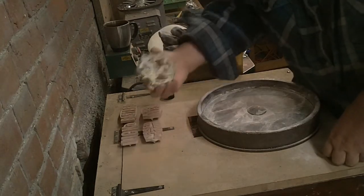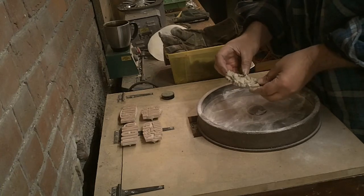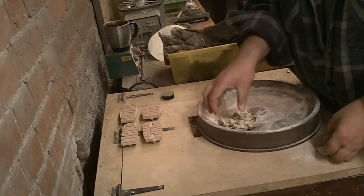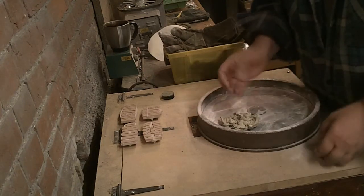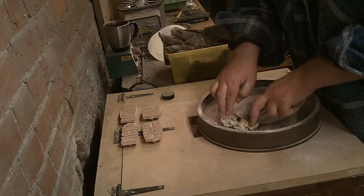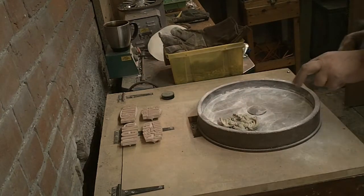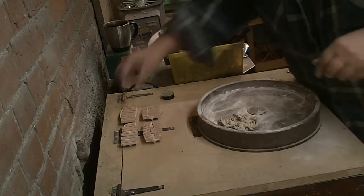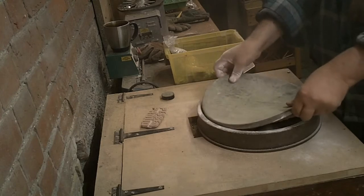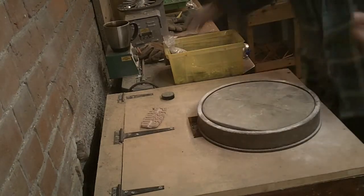Right, let's just lay these out and see what I've got room for. Let's see where I'm going to have the entry point. You have to bear in mind also how the metal flows in and the air flows out — where I'm actually going to put the vents and how I want the metal to flow into the piece. And push that in place gently. That should be fine like that. Let's see what else I've got room for. Let's try and get a balance on here. A little more talc down the top of that.